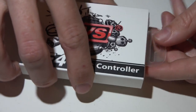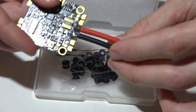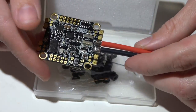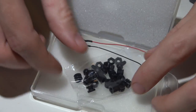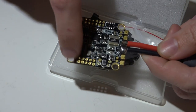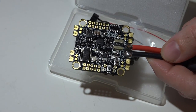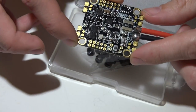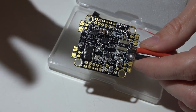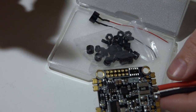When you purchase it, it comes in a box and what you get is the flight controller, an XT60 connector with pigtail — it is much longer than shown, I've just shortened mine and soldered it on. You also get a buzzer, plastic standoffs, hardware to mount it, and eight silicone grommets. These grommets go in each of the four corners to soft-mount your flight controller, much like with the Raceflight Revolt. This is the most effective soft-mounting method out of all the testing I've done.